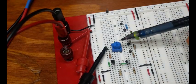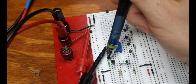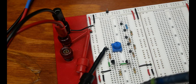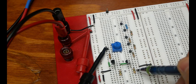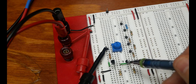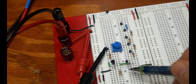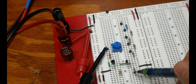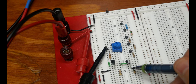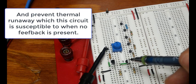Here's the circuit we're going to test. Our potentiometer, our fixed 10k ohm resistor, 3904 transistor — you can see I've got the collector to base shorted so we have a diode from the base to the emitter. These 100-ohm resistors aren't in the circuit right now. I'm going to add these in a few minutes into the lab to show you that without negative feedback it takes a long time for the transistor to actually settle out and come to a relatively steady current point.